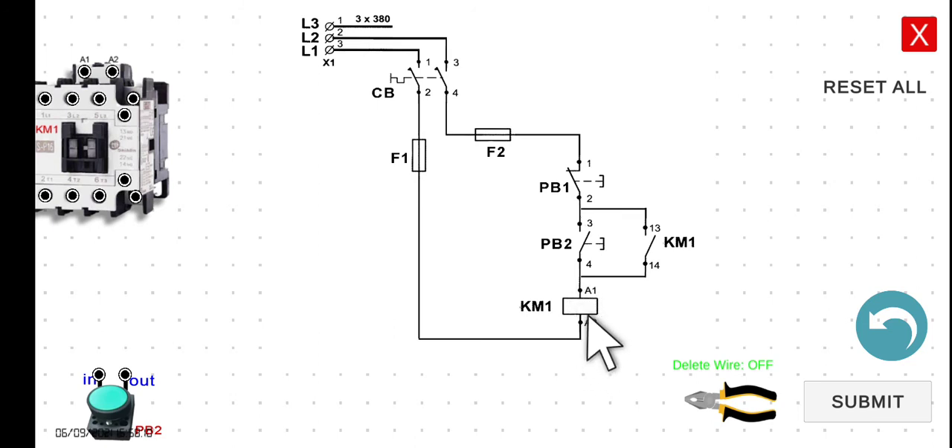So let's have a summary. If you start the breaker, KM1 will still be in a de-energized state. However, if you press PB2, the current will now be able to flow through this path, and since KM1 is energized, the holding contact will be turned on. So the current can flow through both paths. If you release your finger from PB2, the current will not flow through PB2 but will still flow through the holding contact path — so it holds the state of KM1. To de-energize, press PB1 to interrupt the current, which returns KM1 to de-energized and the holding contact returns to normally open.